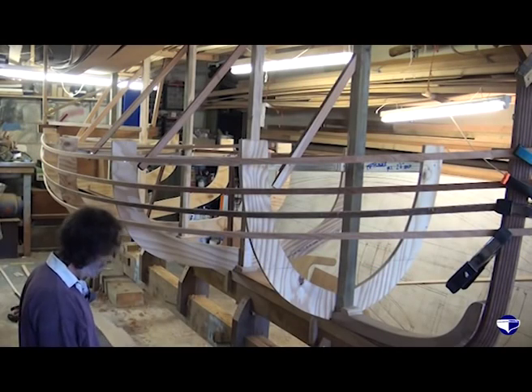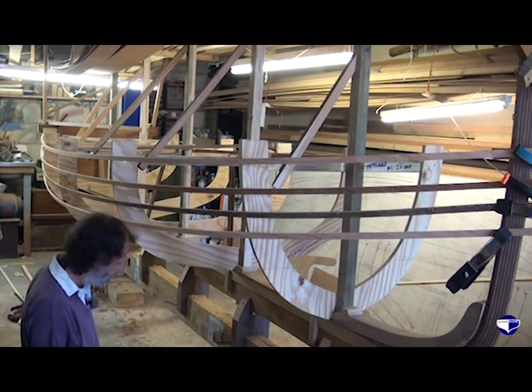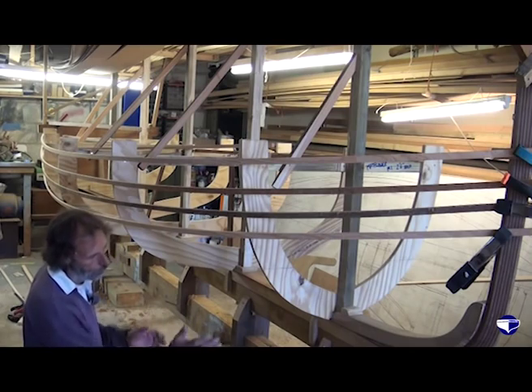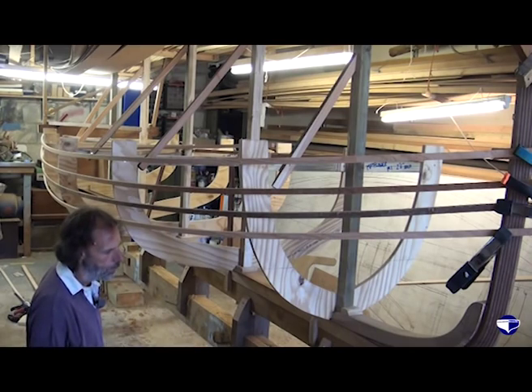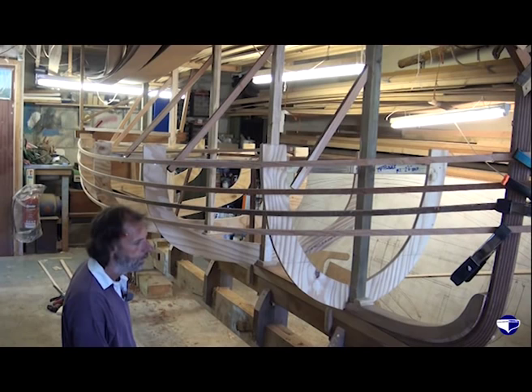So we've got a thin piece of plywood that we've roughly fitted to the keel previously. We've nailed the two lengths together to give us our length in one piece. We'll just clamp that up in place, have a fiddle around at the front end, and then mark off our widths that we've almost decided on. Then lay it on what will be our garboard plank, mark it out, stick a batten around, and just see what sort of shape we're developing out of it.